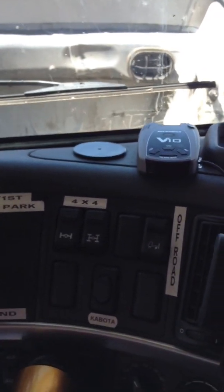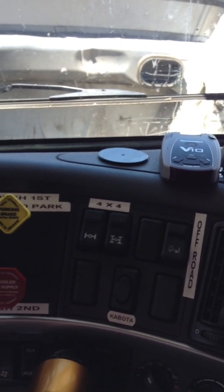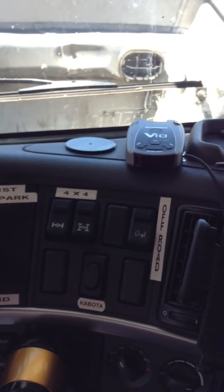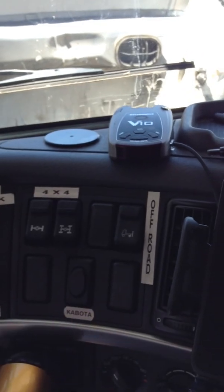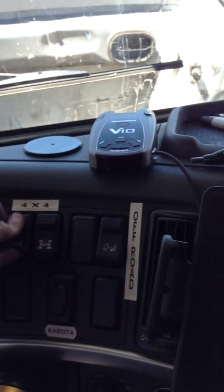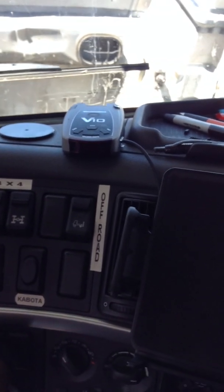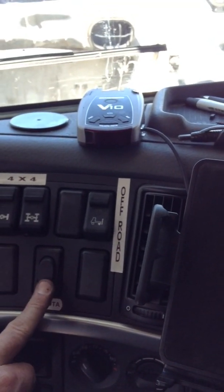When you engage this, you will absolutely have to go on and off the throttle slightly. Make sure you're not spinning, and then you're going to have to maneuver left to right quite extensively. You'll have to do the same thing when you disengage it. Volvo buttons — down is on. You have to push the little release here and then rock them down. That is the on position; that is off. This is your start for your Kubota diesel generator.